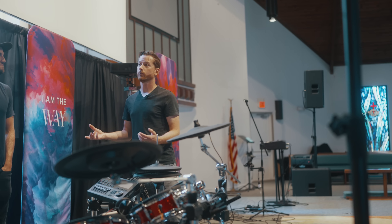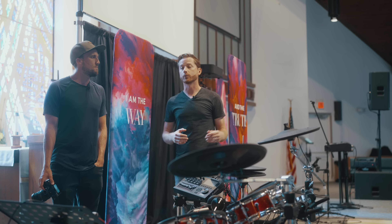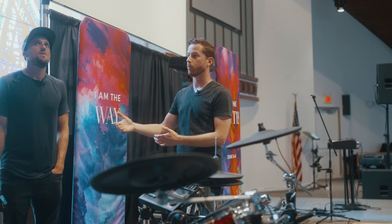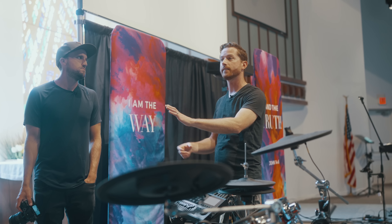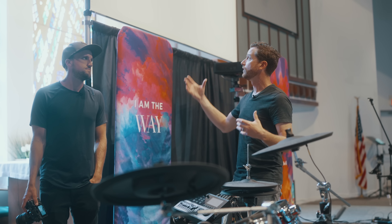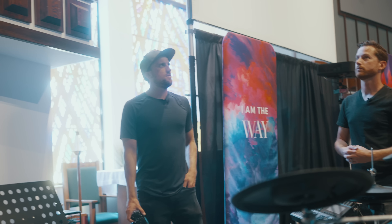The hardest part of this job will be the ceiling height and rigging for the front wash and kick light. The wall wash is an easy test where one light sample can be put up to see the difference. The church may just really want nice front light and no light on the back wall at all. Just because there's a back wall doesn't mean it needs to be lit — there's already a lot of ambient light coming in from the stained glass.